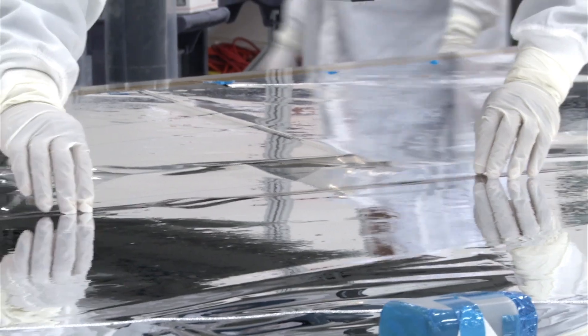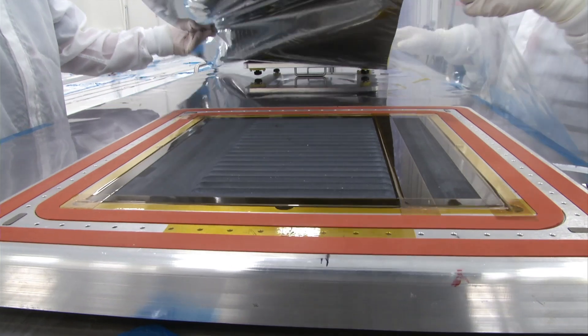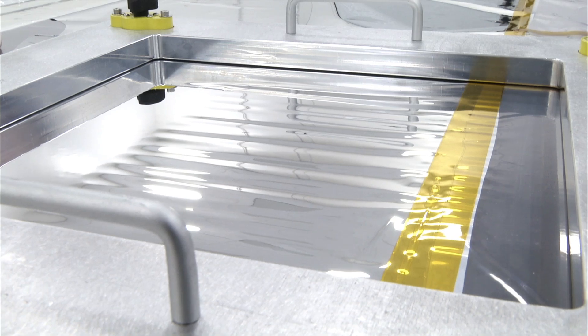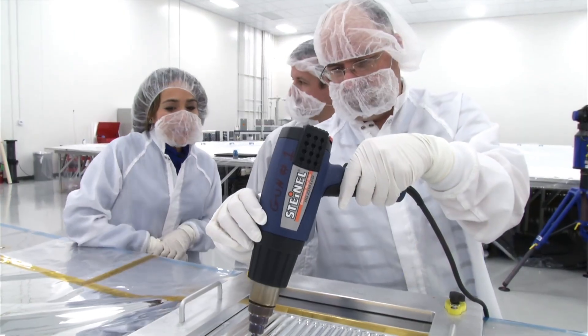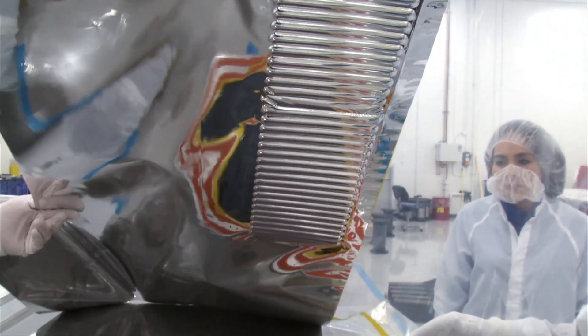Why do you have three people working on the catenary? We can't afford any kinks or wrinkles in the material because it does affect the shape of the membrane. So what do we have here? They're going to place the material on top of the compliant border tool so that we can form a vacuum. So it's actually suctioning it? Yeah, it puts a vacuum onto the film and pulls it down into the shape that we're trying to achieve. This is one of the slowest processes we have. He's very precise about it — it takes almost 12 days to do this around the complete perimeter.